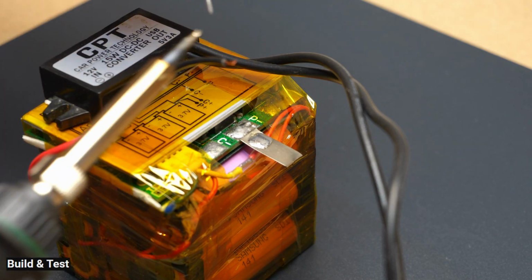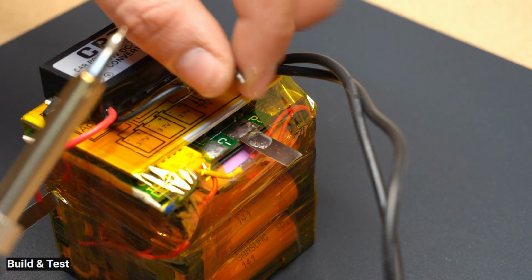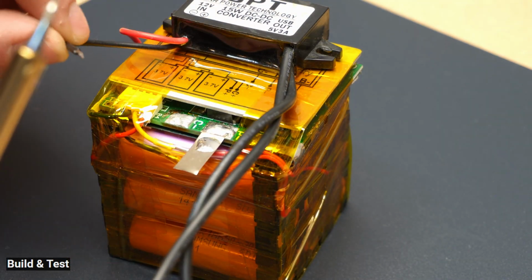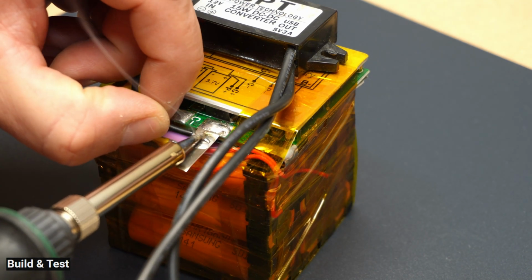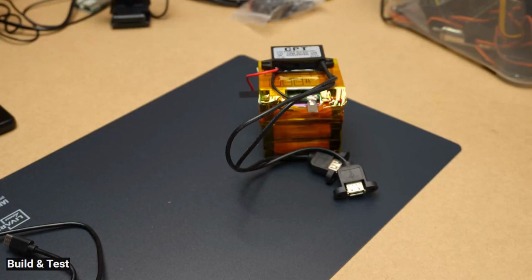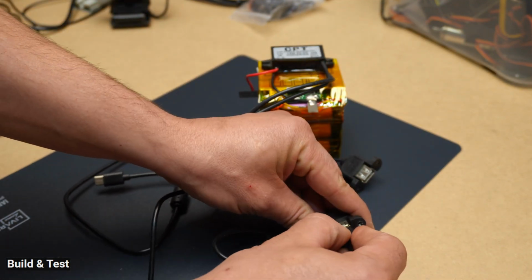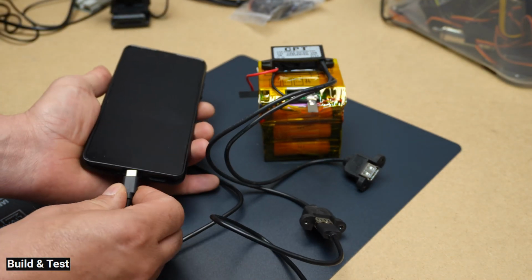Inductor smooths the current and stores energy received during the transistor's on and off states. It helps stabilize the output voltage. Capacitor filters out residual ripples caused by the inductor, ensuring a smooth DC voltage at the output. Control circuit regulates the transistor's switching speed and pulse width, known as PWM, pulse width modulation. The controller senses the output voltage and adjusts the switching cycle to maintain the desired 5-volt output.